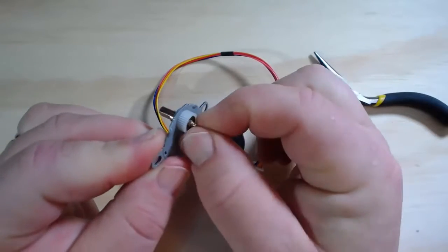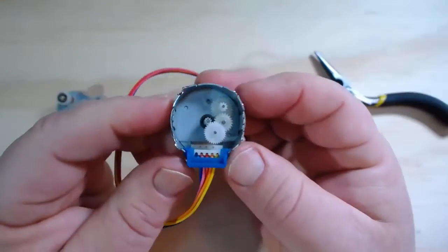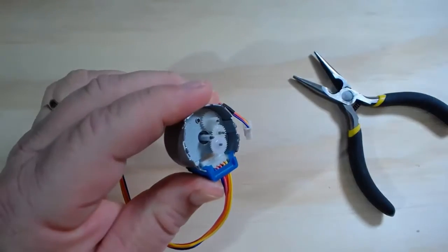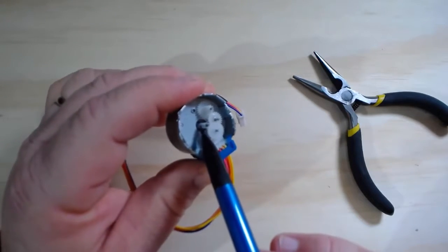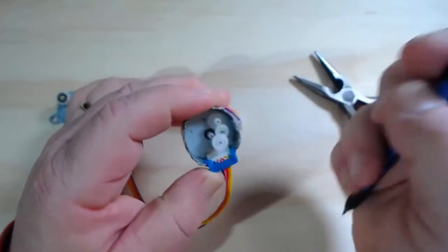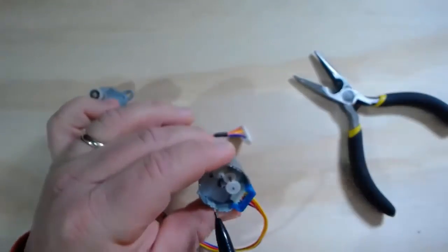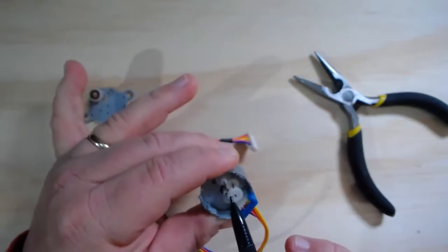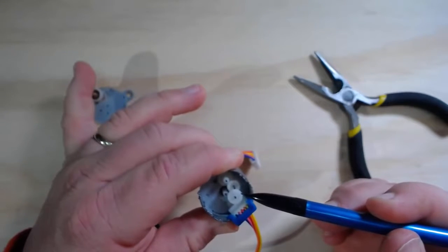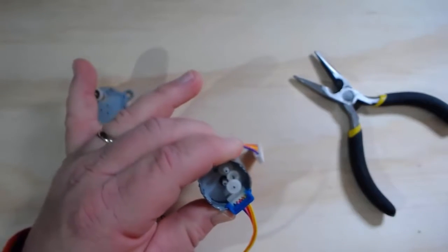If you look inside the stepper motor, there's actually some gears in there. This center shaft that comes out is the actual rotor from the motor, and it's got some teeth on it. It then intersects with this set of gears, and then that set of gears and that set of gears, all the way back to the last one interfacing with the one on the head. That's a 1-to-64 step-down gear set. So basically, for every rotation of the rotor, I only get a 64th turn of the actual motor shaft, giving much finer resolution, albeit a lower speed.